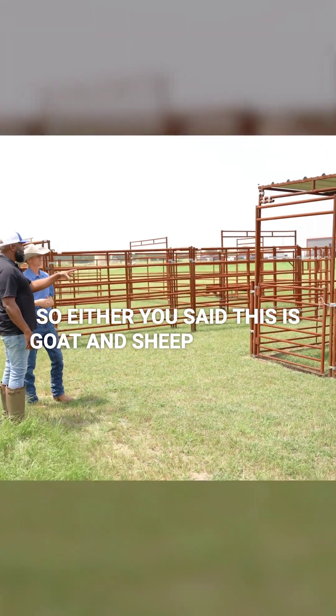What's cool is you can get this basic kit and expand it. If you need a bigger kit, say you want a 10 by 20, you can easily add on to this. Say you want a 20 by 20 — you can make it bigger or add multiple pens side by side. You just set your posts and when you're extending it, panels just slide into each other. You put the next panel next to it and clamp it together. All of our panels are attached using panel clamps. Just a bolt and nut — easy to install. You can take them down easily, add new ones side by side, and do as many as you want. Super customizable.